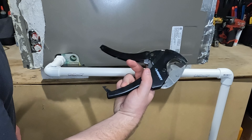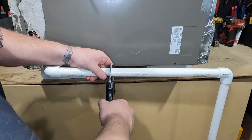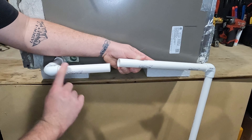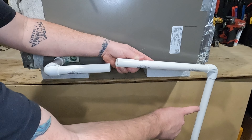Now take whatever you're gonna use to cut the pipe and get into it. Now that we have the drain line cut, we need to flush out this drain line because your water is gonna flow down — most of the time your block is gonna be somewhere on the downside of the system.